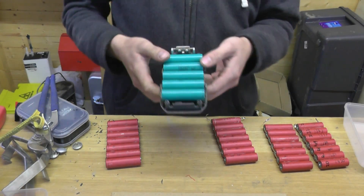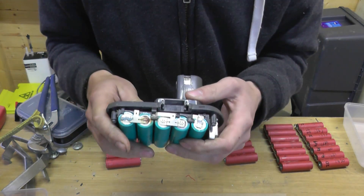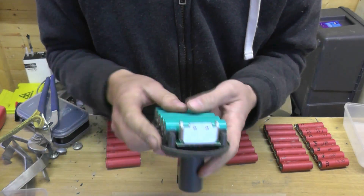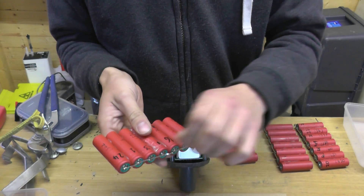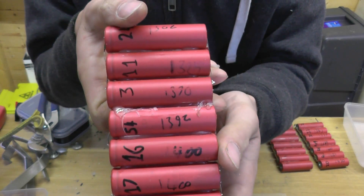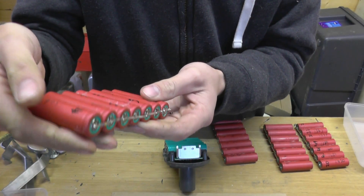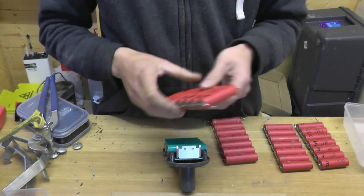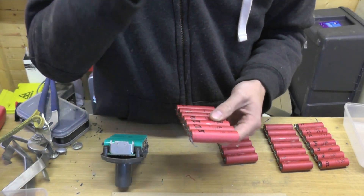Hello YouTube. I'm just going to do a quick video. My idea is to take an 18 volt 1.4 amp hour battery which has been repaired and has gone bad again, and we're going to take out all the cells. I'm going to put in some of these cells from Stu which we brought back up from zero to a usable voltage. We tested all of the capacities and they're anywhere between 1,300 mA and 1,500 mA for this test. We're going to put them in series and parallel to make a bigger battery for something that I'll reveal later on.